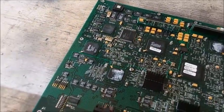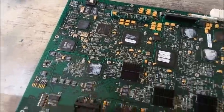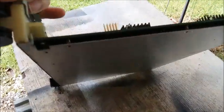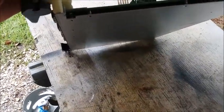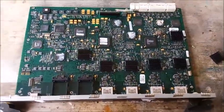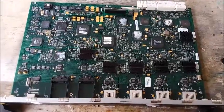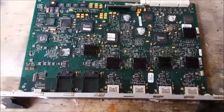There's also a big flat pack IC up there that's going to have some gold bond wires, and some miscellaneous other ICs that'll have gold bond wires in them too. I think this is a double-sided board — I can see some chips on the other side. Once I get this apart we'll see what's on the other side, but seventeen gold corner BGAs is already pretty exciting.